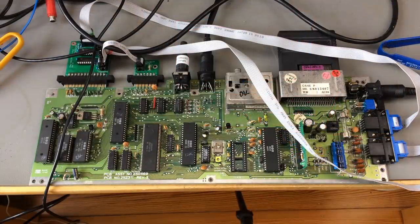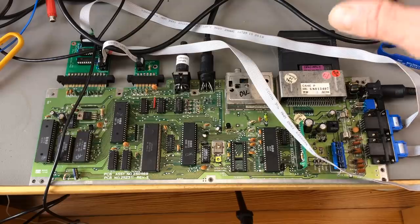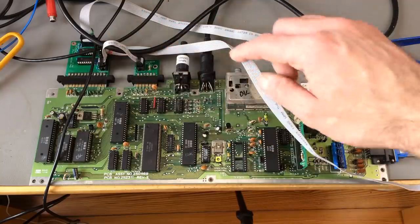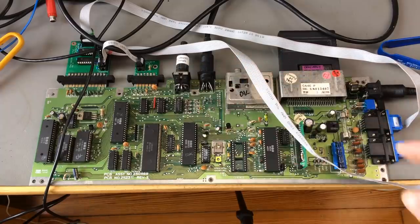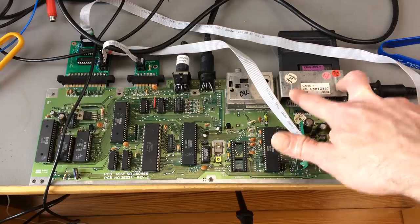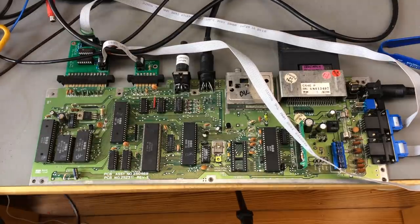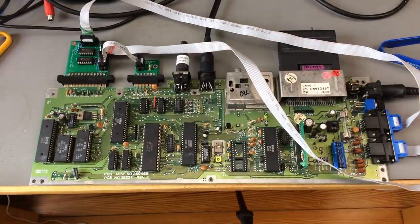So, back again with the ALDI Commodore 64, which has remained a head-scratcher for me up to now. And as you can see, I have something new connected to it. Sven, one of my viewers, donated a little harness that goes with the diagnostics card I'm using, the 586220 diagnostic, which is the standard Commodore diagnostic for the C64. It came with a harness when it was used by repair persons back in the day. And Sven remade little PCBs he designed and made me the cables, which I'm kind of ashamed about a bit, because I was meaning to do this myself at some point, build my own test harness for the Commodore 64, because I usually would need it, and I've never gotten to actually build one.